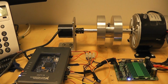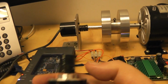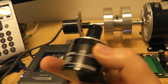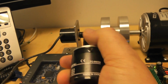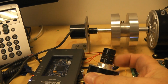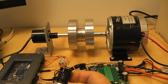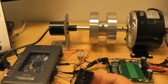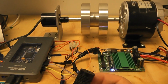But before I do that, just let me show you this before we go into any theory. This is using the FPGA to do everything, really, because I get much better results from the FPGA. So here's my set point. At the moment that's a position servo, and you see how fast it is as well, because I've got a bandwidth of 100 Hz, which is quite high for an old motor like this. It's a bicycle motor, but it's not intended to be a servo by any chance. It's just bought off eBay.